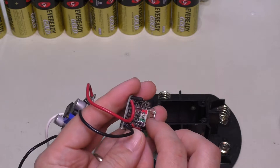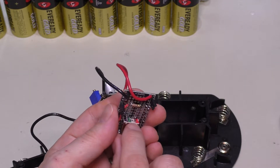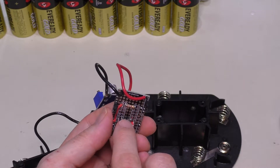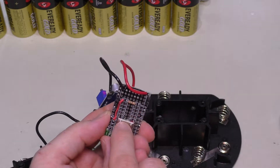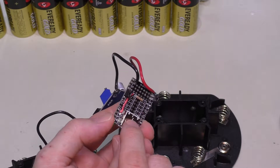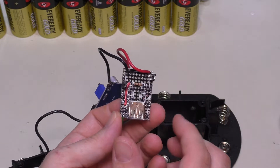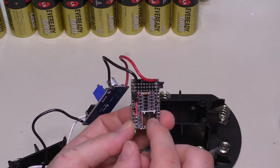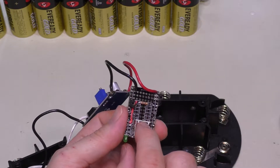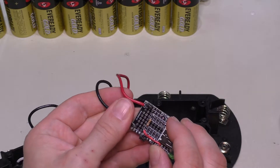What's interesting about these USB connectors — if you actually look, I painted this with red, white, green, and black, which are very common colors for USB wiring. The two in the middle are actually the data connections. So what normally would happen is in a regular charger, they would have a resistor network here, and whatever device you plug in is actually looking at those resistors to tell it how much power it can draw. In future builds, I'm going to explore manipulating that because I want to make this device able to put out as much power as whatever device you're plugging in will draw.